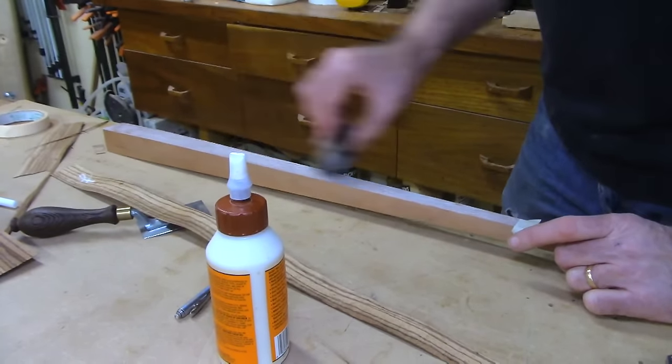I've got some cherry here for a caul. For an open grain wood, the glue will come through and want to stick to whatever the caul is, so I put some paste wax on it so it won't stick. Up here I've got that little change in direction, so I've got a smaller block that I'm going to use to get that first bit. Let's just get some clamps here. I'll get that first three inches or so and set this right up to the front there.